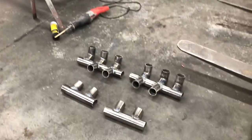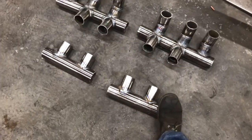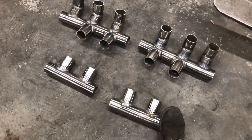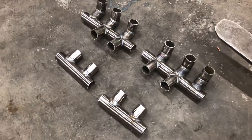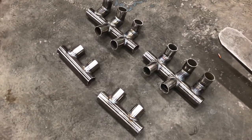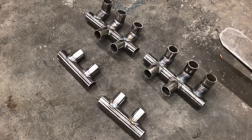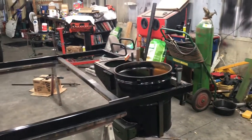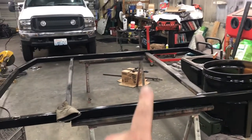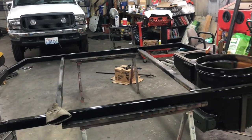That's all four corner posts made up. These are 2-3/8 OD pipe, 3/16 wall, just mild steel. Took a lot of cleanup to get them to that point — I've killed a lot of flap discs on this project. Those are all made up and ready to go onto the bed. I don't have the pipe that will connect all of them yet, so I'm waiting for that to hopefully ship from Rock Auto.